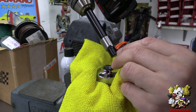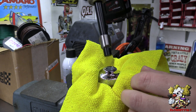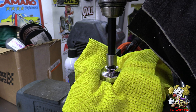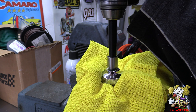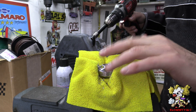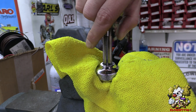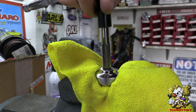Now this is the counter bore tool. You're only supposed to drill up to here — it goes in very slightly, about a sixteenth of an inch, just so when you put the bushing in it seats flush. Be very careful with this because you can break those teeth — go very lightly. Alright, that's done. So I put some Tap Magic on this tap, now try to get it straight in the hole, and turn it down. There she is.